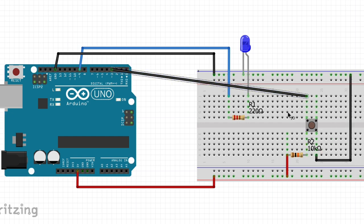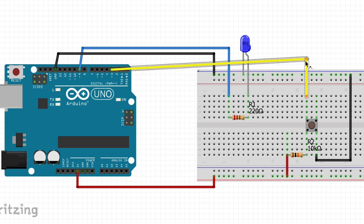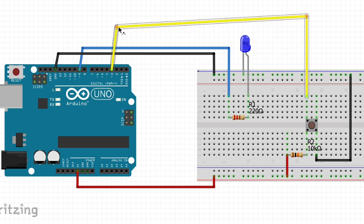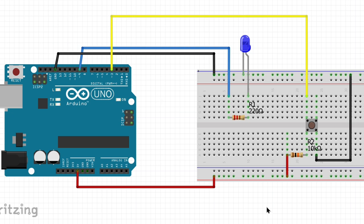Now connect the button pin that is on the opposite side of the resistor to pin 3 on the Arduino UNO. Great work! Your circuit is now ready to respond to button presses and control an LED. In the next video, we'll write the code to make it all work.